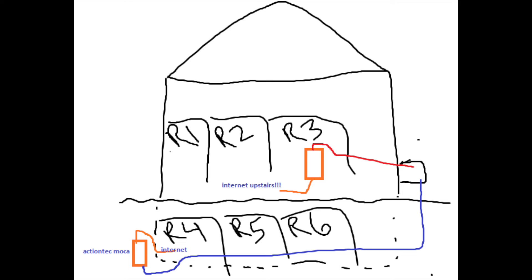We'll go upstairs and plug another ActionTech in, hooking it into the coax jack as well, and this ActionTech knows to become the receiver. Now when you plug in the Ethernet, you can plug it into a computer or, in my case, into a network switch so you can have more ports at the upstairs end where you don't have Internet. I've now connected these rooms together without running any cable, because I'm using the existing coax that was already there. This works because the rooms are technically connected together at that common connection point where all the rooms' coax comes together at the splitter.